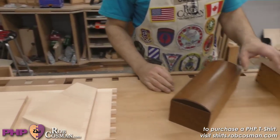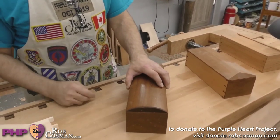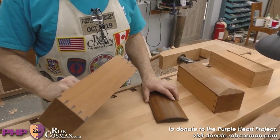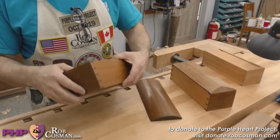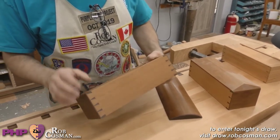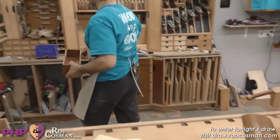And here are some of the boxes that I've done over the years when we've taught the class. We used to do this, now we brought it back because we've increased the length of the class. So this box is made out of poplar and mahogany, has half-blind dovetails so that you can cut a groove in the bottom. And you can cut it with our drawer bottom plane, which is this little thing right here.